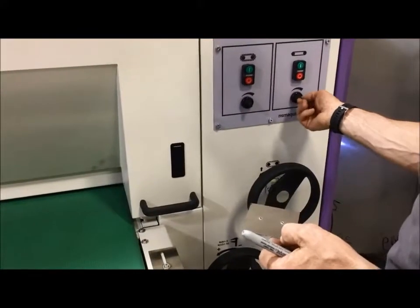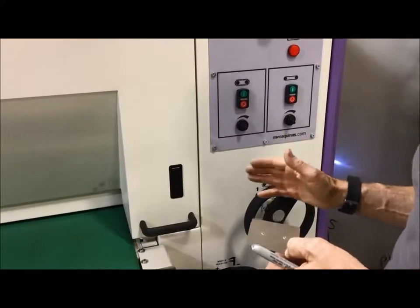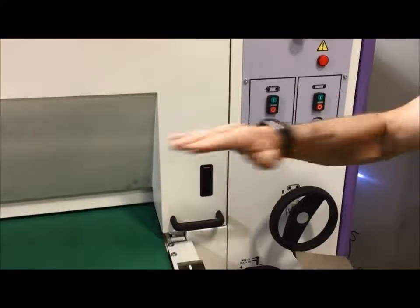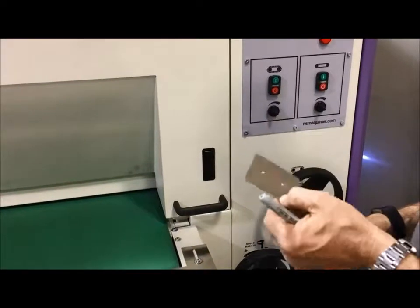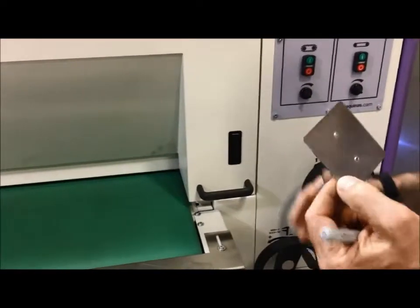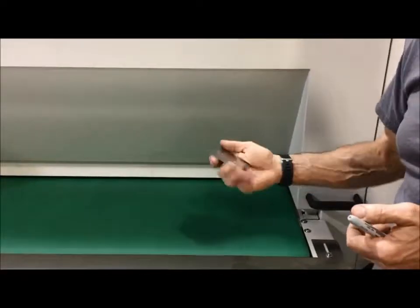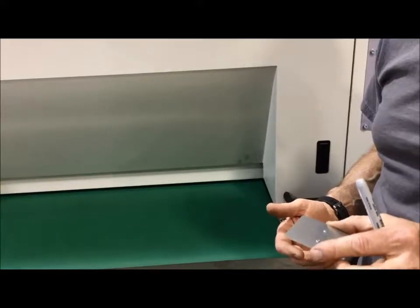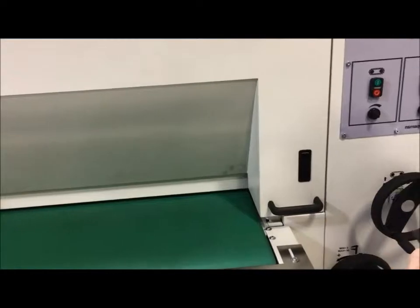And actually, because the part is small, you want to increase your conveyor belt speed a little bit, because that makes the transition for the small part from the pressure roll underneath the cross belt a little bit easier, and it'll hold better. With a small part like this, you may have to run 2 passes. And as you run 2 passes, with a small part like this, you could run thousands of them in an hour if you can load them fast enough. It's really not all that relevant whether you run once or twice. It goes very quickly if you had to run a second pass. The important part is that you can do it.